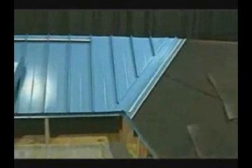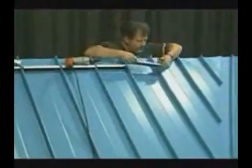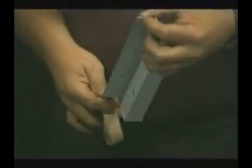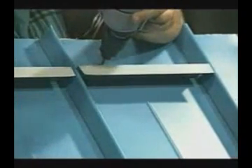After one side of the roof is complete, we will begin finishing our trims. As we stressed before, the roof is not totally weather-tight until all trims are complete. We will do this by either using our ridge as our guide or measuring down from the ridge to give us the proper location for placement of the metal Z closures. We will then apply caulk tape to the back side of the Zs as a secondary leak prevention, and a series of screws will then be installed to hold the Zs in place. These also positive fasten the panels to keep them from sliding down the roof.